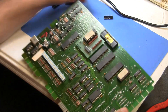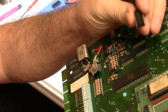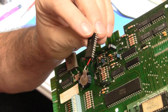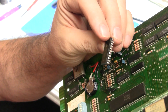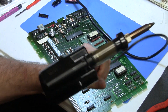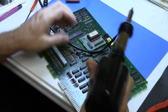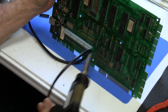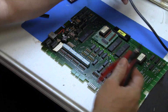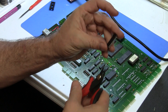You'll see what I've done here — I've actually removed the chip. This is the old chip. I cut it off, and this is a little bit of a touchy area of work to do. What you do is use a desoldering iron — I'm using the Hakko 808, my go-to desoldering gun. You just plug it in, hold the board up, and desolder it. Then I use some very fine nippers to cut the chip off of the board.